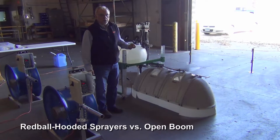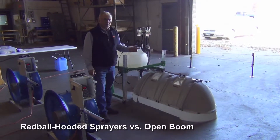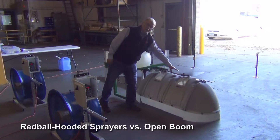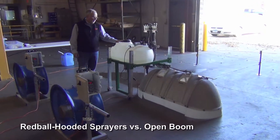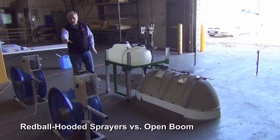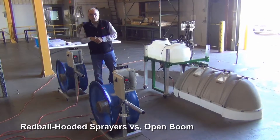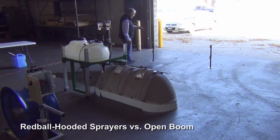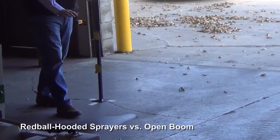In today's illustration we're going to use XR tips at 40 PSI for a fine droplet size, and AI XR at 40 PSI for a coarse droplet size. We've got windows here that are not standard on our hoods, just so we can go in and change the nozzles when we want. We have a 25 gallon water tank, sure flow pump, red ball monitors, and pressure gauge. On this side we've got two fans set up with variable speed control boxes so we can make sure each one's turning the same revolution. Back here, 10 feet behind the boom, we have water-sensitive paper at 12 inches and 24 inches above the so-called canopy — the concrete.